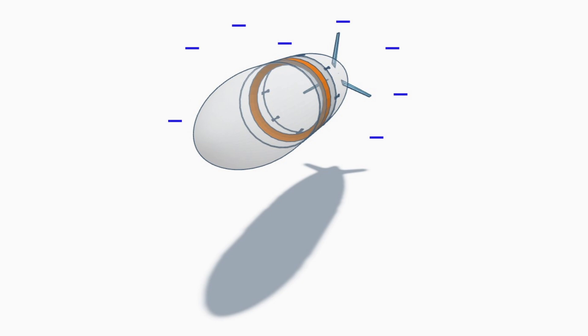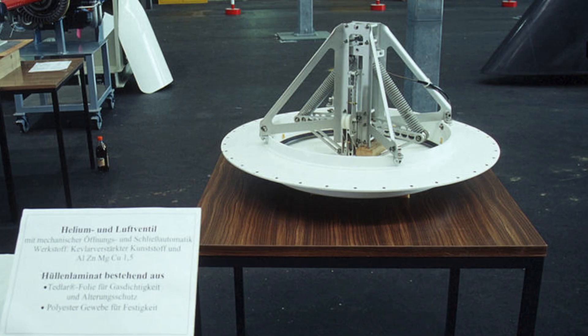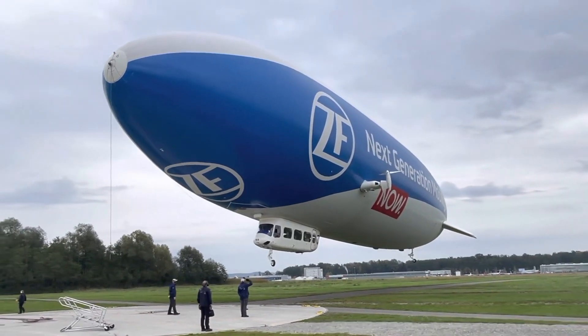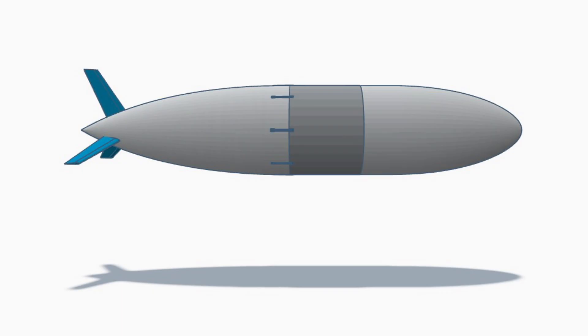The concept is similar to a typical active ballonet like those used on full-size blimps. However, active ballonets rely on electric pumps and control valves to control the volume of the ballonet. That's fine for a big airship, but it's a problem for small airships. All those pumps and control electronics add weight and complexity and power requirements and all sorts of problems — not to mention they tend to leak. Instead, the passive ballonet does this naturally by virtue of the way tension and pressure is managed within the envelope.